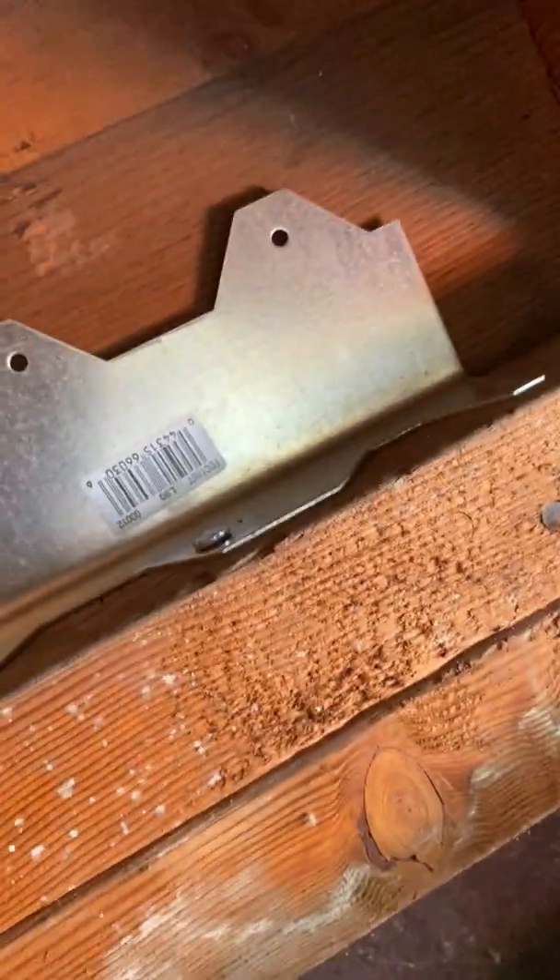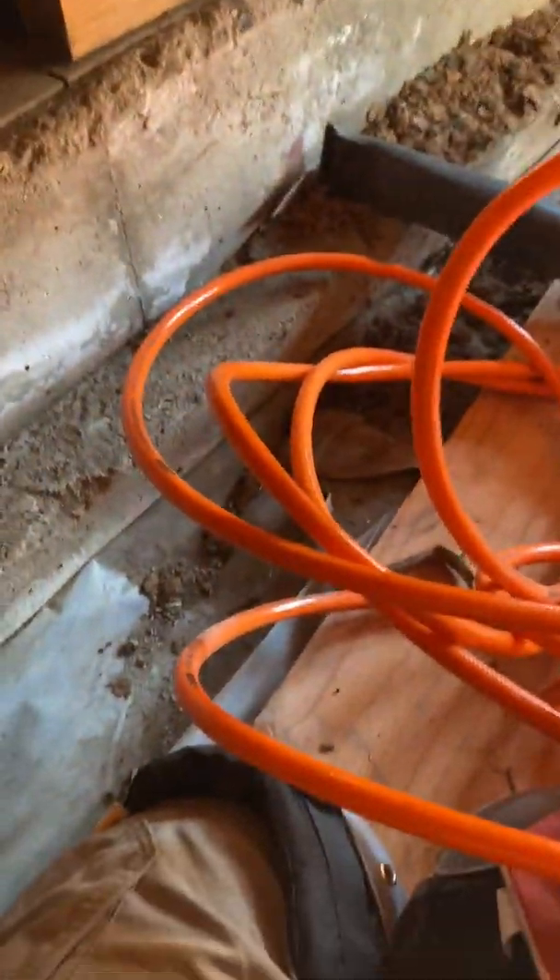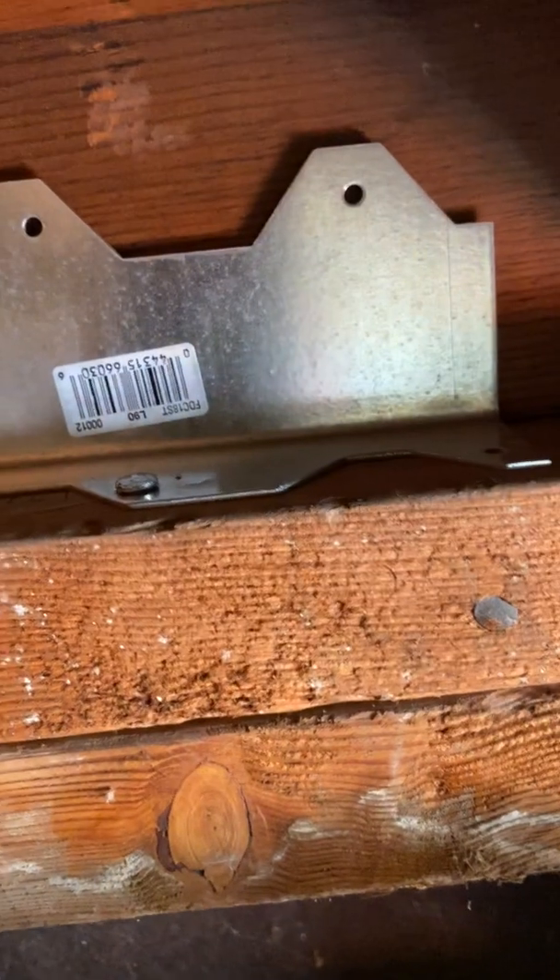Okay, it's not supposed to be that difficult. A lot of dust — that's why you've got to wear a dust mask like I have here. I got this one from Harbor Freight, pretty good. So that's what it is: five on the bottom, five on the top with 10d nails. That's how it works — you've got one here, same thing.